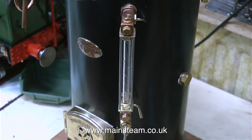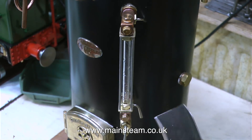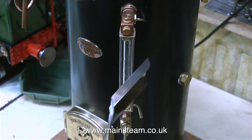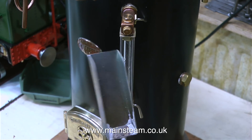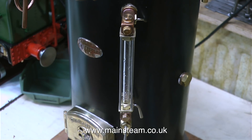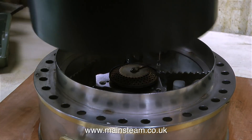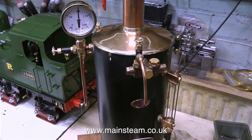It's time now to test the water gauge. So here's a shovel, and there's the water gauge. Now if I did this without this protector being in place, there would be several pieces of glass on the bench. In this design of water gauge protector, there is no contact whatsoever between the metal bars or the fittings and the glass. It's time now to give it another steam test. I can't run it on coal as of yet, because I don't have any way of getting water into the boiler. Coal fired boilers need to be fitted with two devices for pumping water into the boiler - that's why I'm running it on gas.